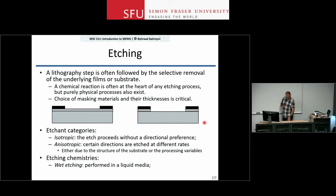You can also talk about different chemistries for the etch — wet etching or dry etching. In a wet etching process, you etch in a liquid phase: you have chemicals in liquid phase, put your wafer inside that chemical bath, reactions happen, and you remove the wafer after a certain time. Or, you can do it in a gas phase using gaseous reactants and particles to remove material from your substrate — that's dry etching, covered in the next video.